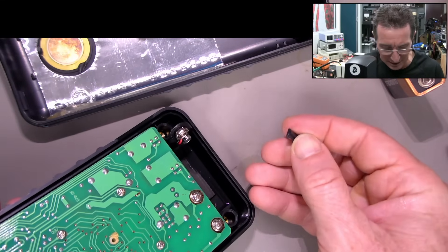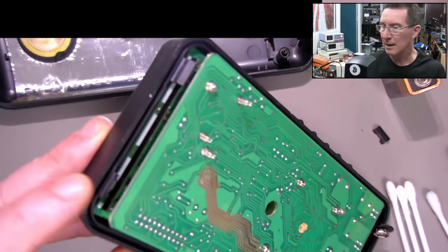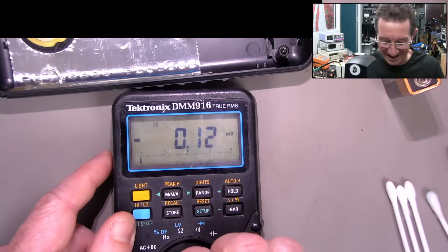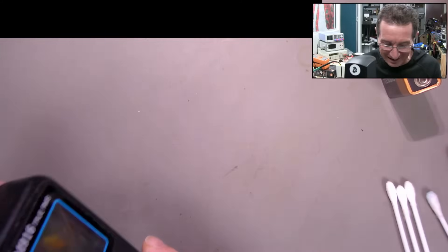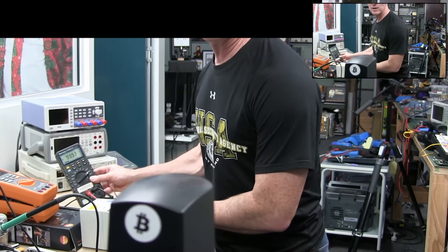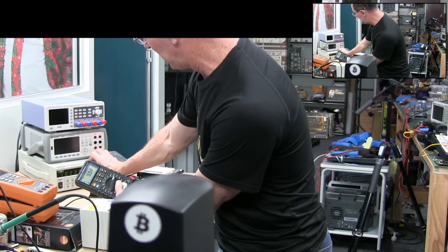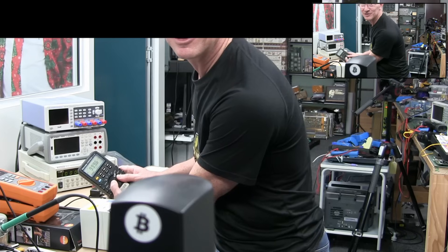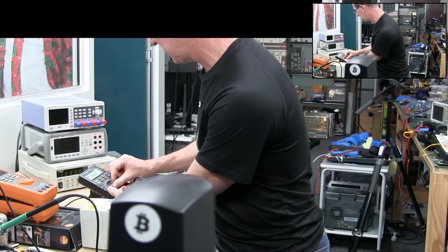There was something rattling around in here - it's a plastic clip. Yeah, it's broken off from the top - they've got those two clips on the top. All right, we've got a fresh battery. I reckon these are all going to be good. Let's try it. Milliamps: 99.93. 10 milliamps: 9.97, 9.98. And 1 milliamp - going to 1,000 microamps. That's all good. Current is fine. The amps jack - no worries.